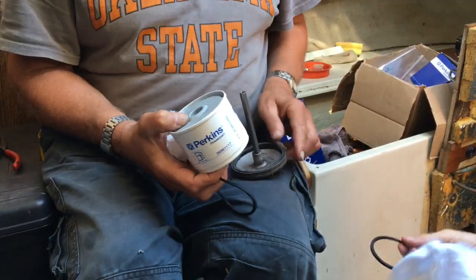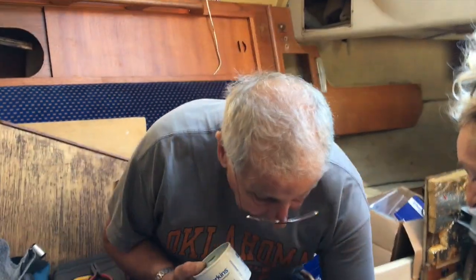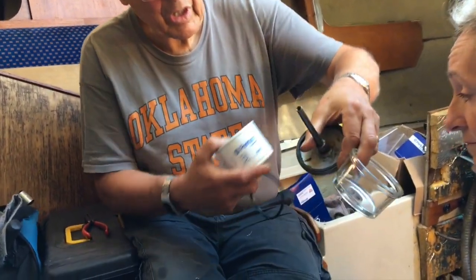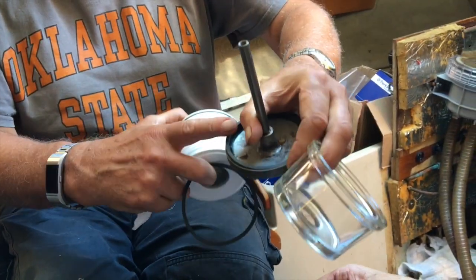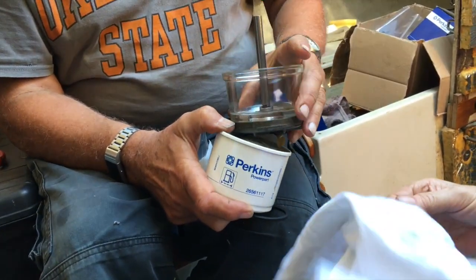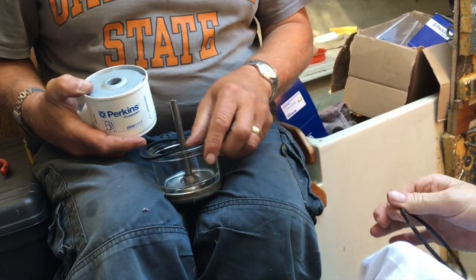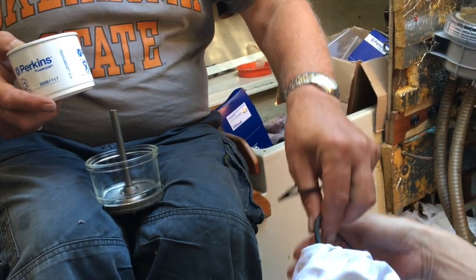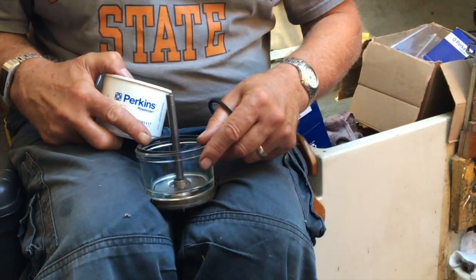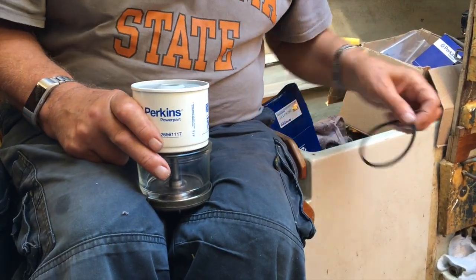So that's fine. Okay, the trouble with the CAV296 system is when they give you a new filter, if you've got an extension on like we have here, they never give you enough seals. So it's one seal short. So I've changed the seal in the bottom there. You can see that is the one that came with the filter. So that's a new seal there. That fits on top of it. And then where the filter goes onto there, is it that one? Mm-hmm. We have to reuse it, and I hate reusing seals. And then that one there goes in the top there.